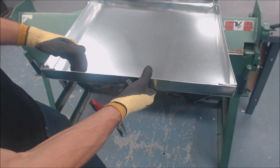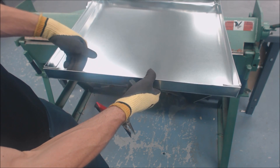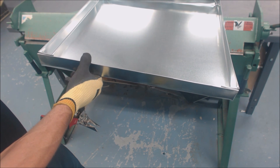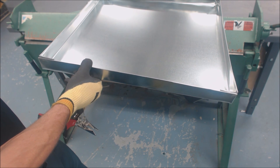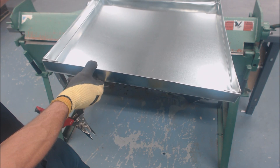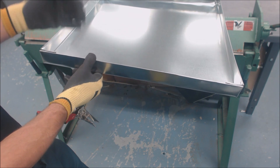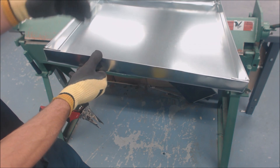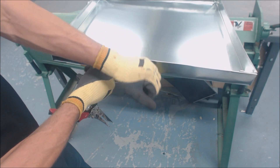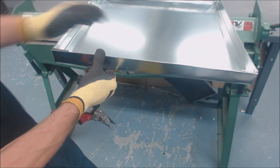During preventative maintenance, if there's any water or condensation, make sure it did not stick the styrofoam to the metal. That's why you also want an emergency condensate switch in the evaporator coil pan — different manufacturers have different ones, but one is called a safety switch. If the pan starts filling with water before it overflows into this pan, it should cut off the air conditioning. You can cut off just the Y for the compressor, or cut off the R for main power to the thermostat — cut off your low voltage. You should never have water in an emergency condensate pan. If you have water in this, there is a problem and you need to take care of it.